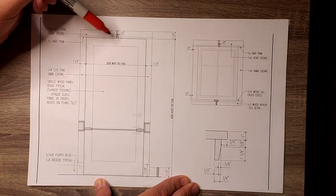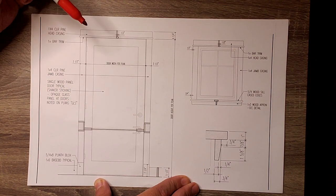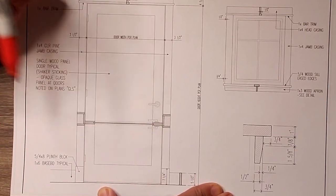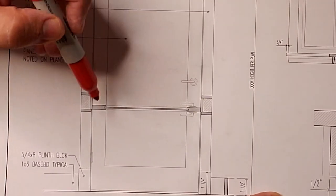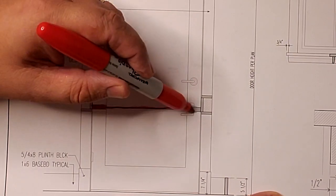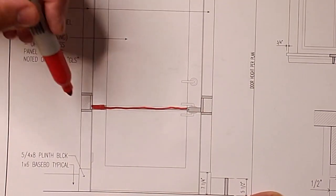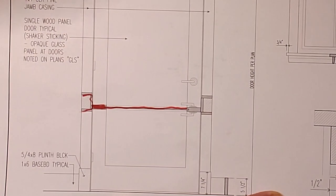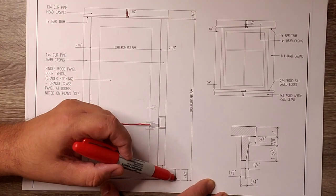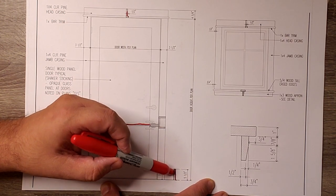Here you can see a quick door elevation. I like to do my door elevations with a superimposed section across them — it just helps everybody understand what is rail, what is panel, handles, some of the trim around the wall. I do that across the head and across the base as well.